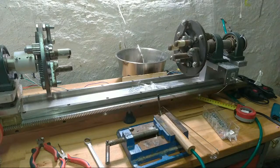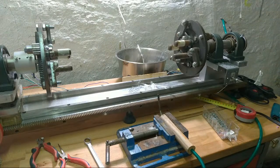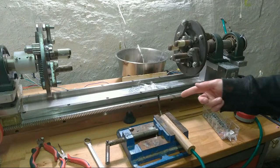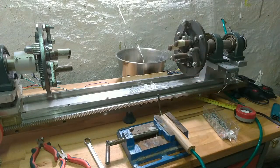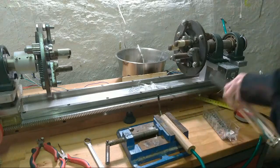I'm going to break that something today, I'm pretty sure. Also, the thing with this propane mixing into HHO gas is, what's great is that I have basically no flashbacks. Even if I got some flashback, it will pretty much stop inside the tube because the concentration of propane will start to rise and it will not be able to support flame.